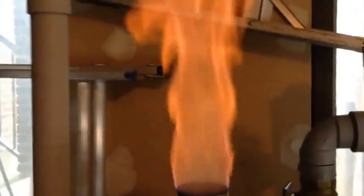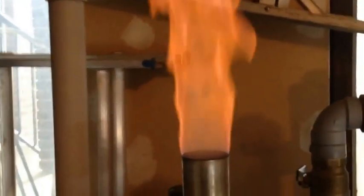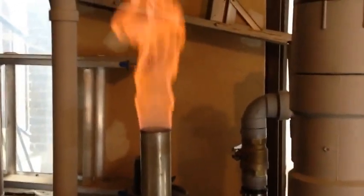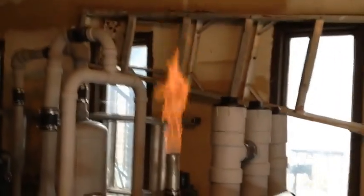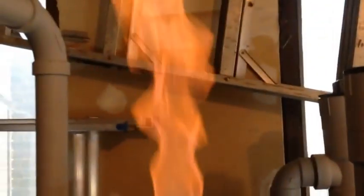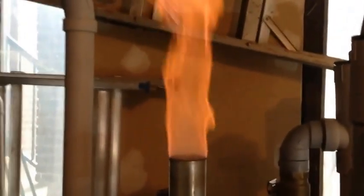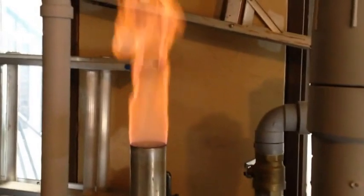This flame looks actually pretty good. The machine is working really good. I can actually turn that down if I wanted to. Right now I got it to about five volts - but it's still looking really nice. Now, if your gasifier gets too cold or there's not enough suction, by putting my VARIAC and bringing it down to about five volts, it may not be enough suction. The flame will start to dissipate because it's getting too cold. But for now it's looking good.